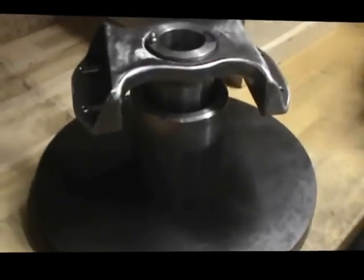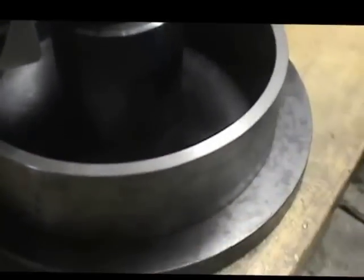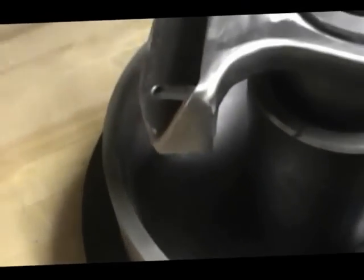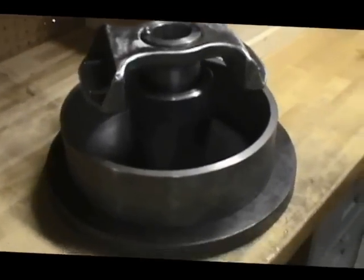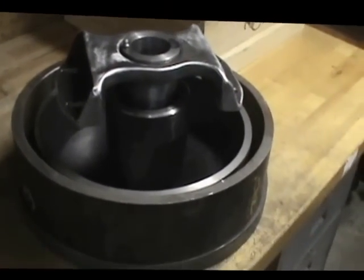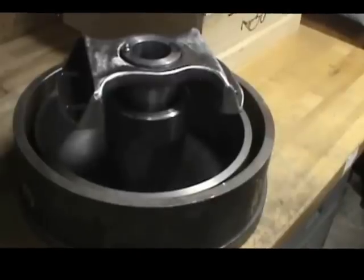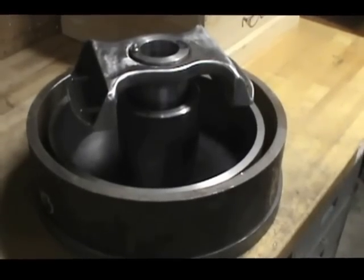We're kind of anxious ourselves to pour the babbitt material. And what Byron has here is the spider friction plate. He has milled this out with a taper. The inside of this is tapered, thinner here, thicker down here, so when it rides on these wooden blocks it'll engage right in there. As you can see, we got quite the thing going here. And this is the outer ring which the belts will ride on that big plate. I know it looks kind of confusing at the moment, but once we get everything done, get all put together, you'll see how it works, and we're hoping it works good too, because this is our first clutch we ever made, probably our last, but there it is. We'll keep you updated as we move along.